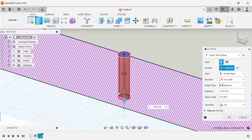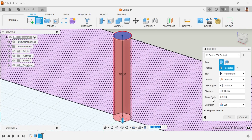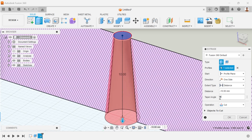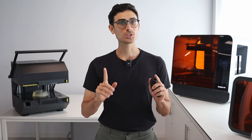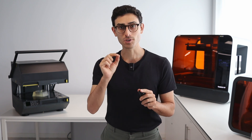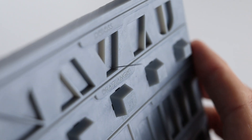Keep in mind that in some cases resin may get trapped in those tiny air holes. To prevent this, we suggest adding tapered air holes that are tiny on the surface of the template and gradually increase in size as they get closer to the bottom. We also recommend checking and cleaning the air holes before the curing process by using a needle or an air gun.